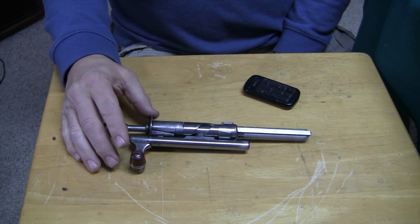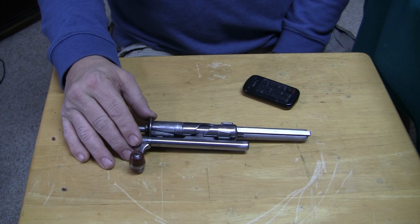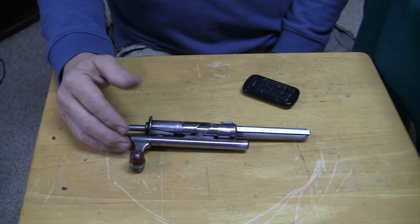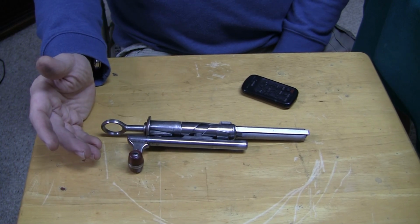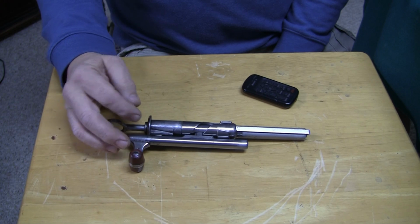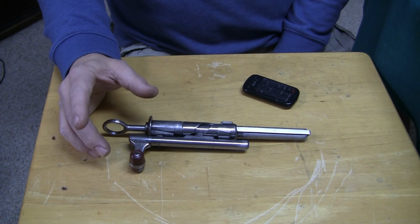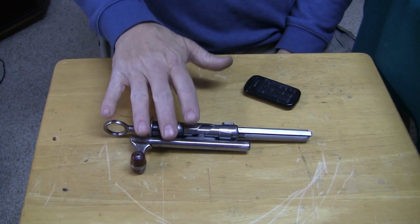Somebody could have put it in there because they disassembled the bolt, okay, and lost the parts. Take it apart one weekend, leave it there for a number of time, you know, months, years, then go back, hey, where's the spring? I got to find something close. So they put something close in there, okay? That is obviously the spring that was in there is not the spring that belongs in there. It was the wrong length, wrong diameter. Close, but not exact. Henceforth, I believe that's what caused the problem.